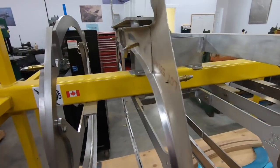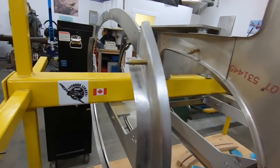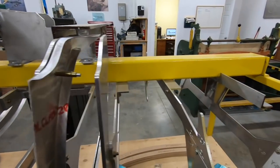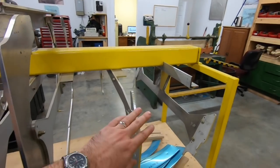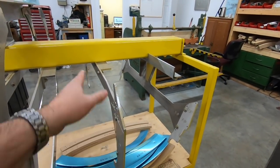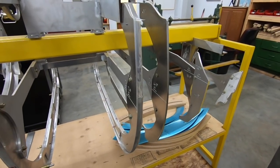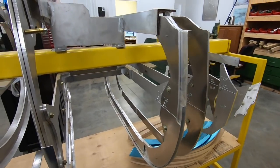The spine itself is all machined. It's got machine points along it to hold everything true and in their correct locations. Station plates are calculated based on those hole locations and hold the radiator fairing stations in their correct spot.